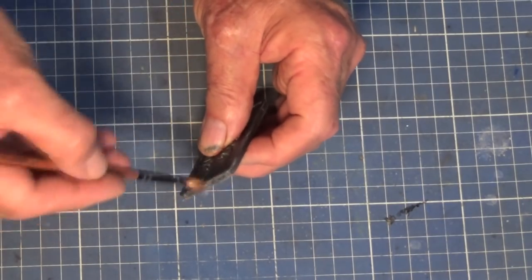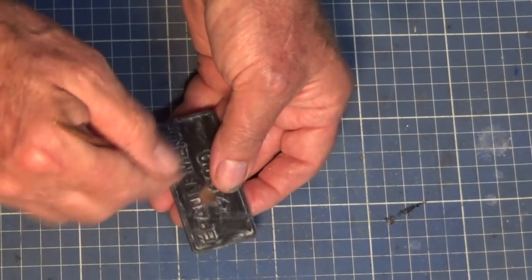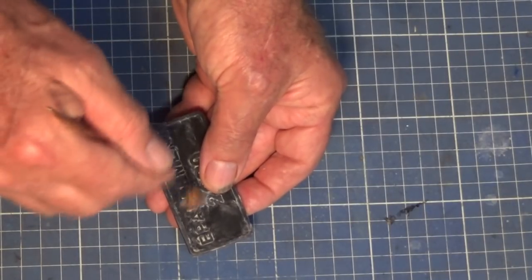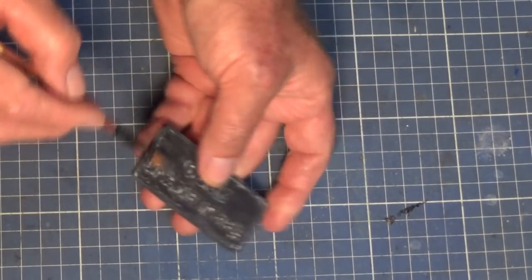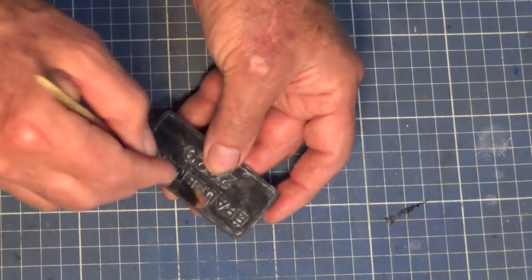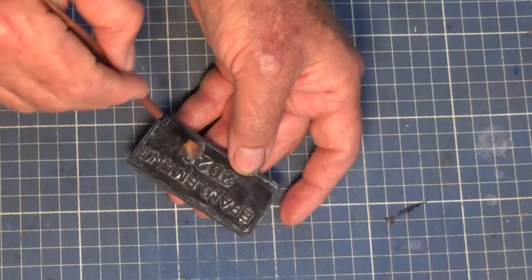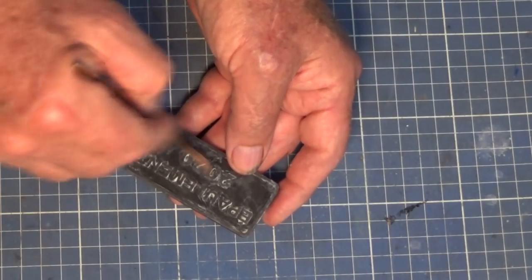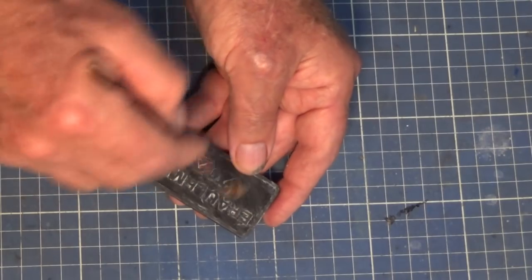So remember, the draft angle is really important, and the more you can have, the better. When I was modeling this, I did this one in Autodesk Inventor, but Fusion's pretty much the same thing. I found that if you draw the sketch for the lettering on the top of this section and then try to extrude it upwards with a taper angle, it would fail beyond 2 degrees of draft angle. It's to do with the geometry of the lettering itself.